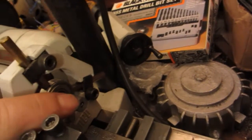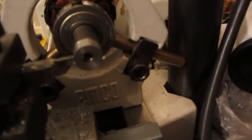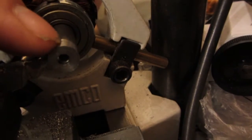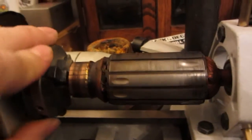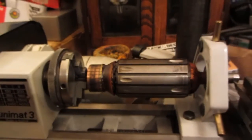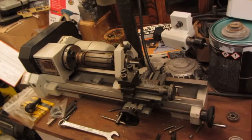Eventually I'll turn that down. It's already got a 3.5 millimeter hole drilled, then tapped to M4 for a screw thread — you can just about see the thread in there. That's been threaded already to accept a screw which will hold the pulley onto this shaft once I turn it down to six millimeters diameter by about 20 millimeters deep, stopping just shy of where that bearing is. I know this armature is in perfect working order — the reason it was thrown away is because the drive shaft was snapped. Now I'm repairing it and it'll be as good as new.